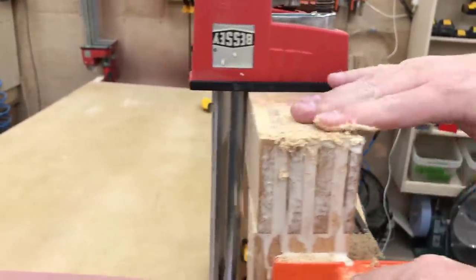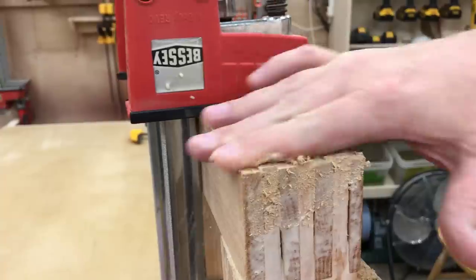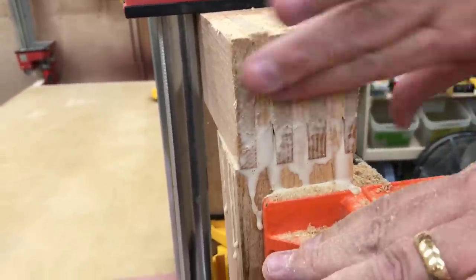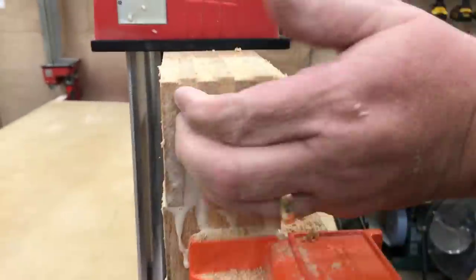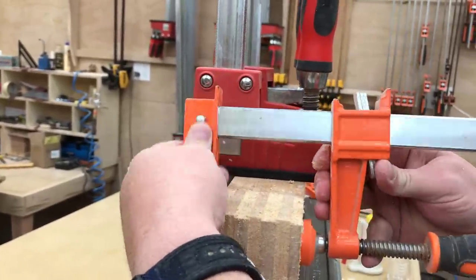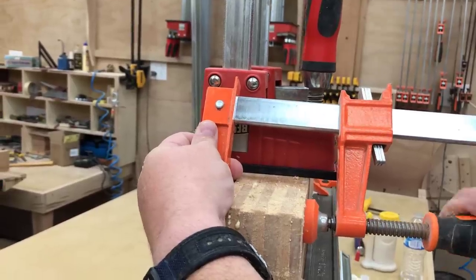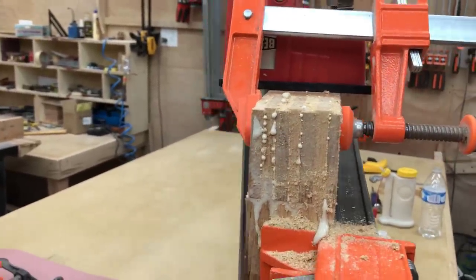Okay, we have to pack these wounds with massive amounts of sawdust to prevent hemorrhaging. Okay, maybe I was kidding there, but this actually has a really good function. Every so often you have these joints that don't quite fit together perfectly, or at least you see little hairline gaps in them. If you do this now, before you clamp it down, any little gap that you might have had will be 100% invisible when your joint is complete. Try it and you'll see.